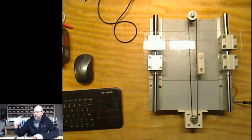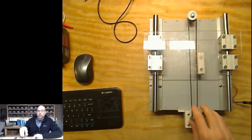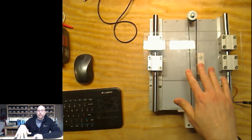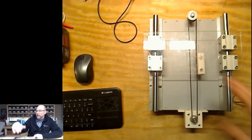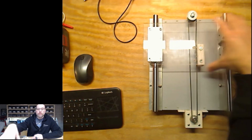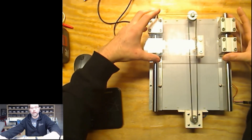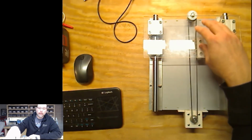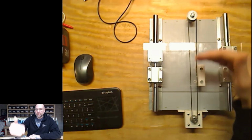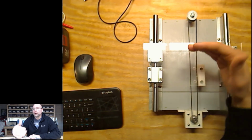And then my thought process is I'm going to have the same Arduino that controls the reader control the motor. So what will happen is, as the hand moves into the field, as soon as it detects a read, it will stop. And then I'll be able to calculate out the distance from the reader. So I need to basically build in sort of a zeroing mechanism. So this will come up and touch the reader and say, okay, this edge is 0, and zero itself out. I also plan on adding some gradations to the sled itself. So, 1 millimeter, 2 millimeters, etc. So that way I can correctly figure out exactly how far in it is.